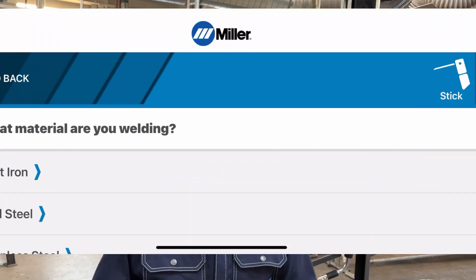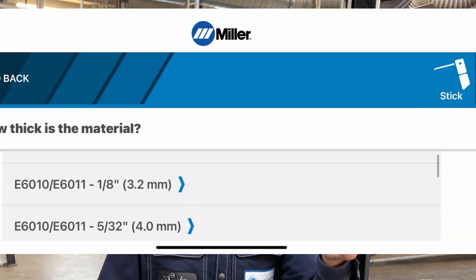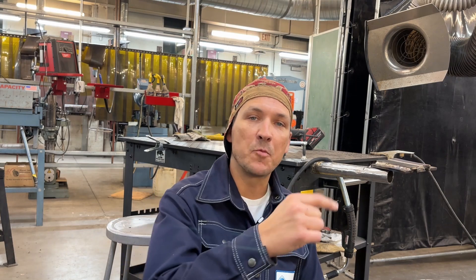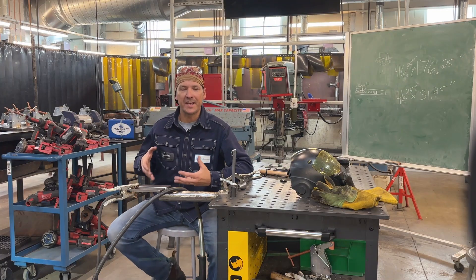These settings may not work for you if you're not on a Lincoln machine. Find yourself a weld settings calculator online to get a ballpark range and work from there. The biggest thing is to understand the relationship between your wire feed speed and your voltage. If you're brand new or haven't been at it for a while, go back to my other video on seven things not to do for MIG welding — it covers stick out too long, too short, too low voltage, too low wire feed speed. I've got my plate all set up with no gaps and it's nice and clean.